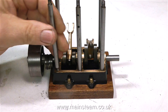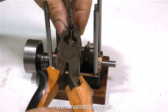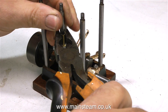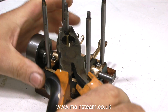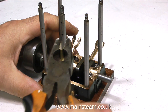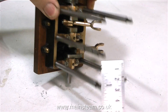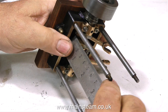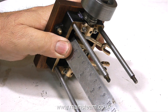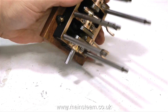That's what the drawing says anyway, and that's not including the thread. It's vital that the 3¼ inch dimension is the same on every one of these columns. So what I'm doing is removing the columns using my piece of brass method to stop the pliers from marking them, and I'm going to refit the columns and make sure that at the top they are exactly 3¼ inches from the base. The number shall be 3¼ — the number shall not be 3, and the number shall definitely not be 3½.